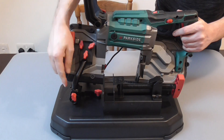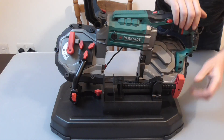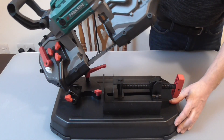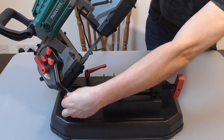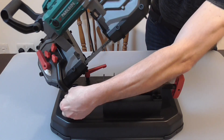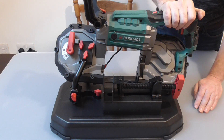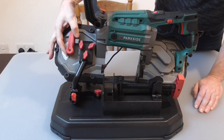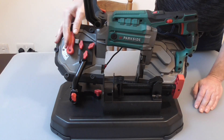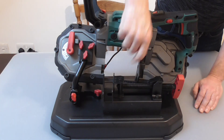On the machine there's a lock here for the swing arm. So when you raise the saw, it automatically locks into place. It's very important you don't try to force the saw down after it's locked — just pull it to release it and then drop the saw back down again. There's also a lock for releasing the tension on the blade; make sure it's in the upright position or the blade won't actually turn.